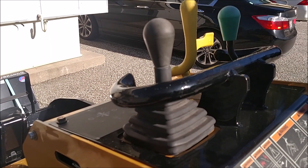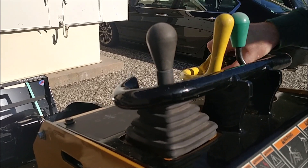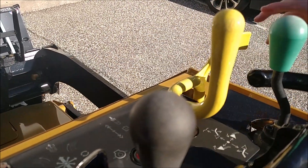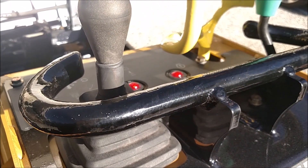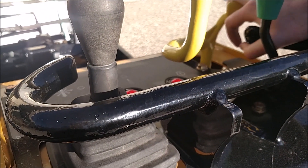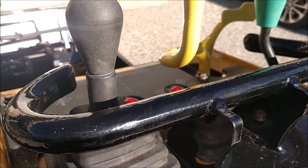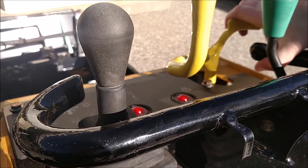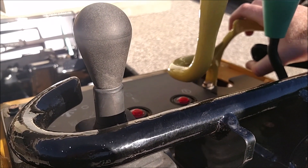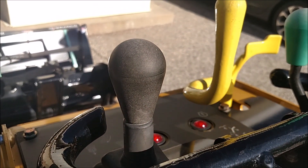This button takes care of all your attachment manipulations for your hydraulic auxiliaries — it's always going to be in high flow. So when you're running your log grapple, if you completely squeeze this in, you'll hit hydraulic with no hydraulic relief, and potentially you can kill the motor. Make sure you never go all the way back — feather it properly. When you hear the engine bog, that's a good time to release.